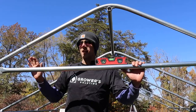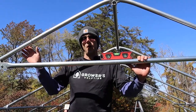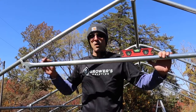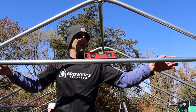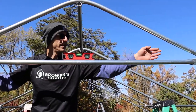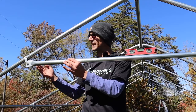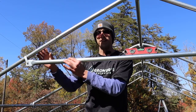Along with the gusset on the corner, we're adding a truss to the 16-foot-wide Dakota house — only on the 16-foot-wide houses, again for weight distribution. Make sure the flat side of the tension bands is on the outside so we don't rub our end films. Get a level — this is a six-foot flattened and punched pipe. Once you have it level, that's your placement; we just want the truss to be level, we're not worried about a measurement from peak to end. Once secured, go through with nuts and bolts, then put a tech screw on the inside of the bow facing away from the end wall film to maintain its position permanently.